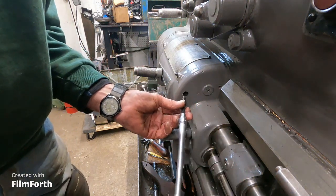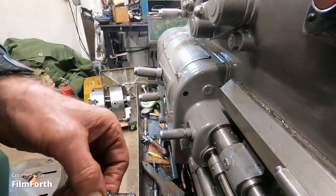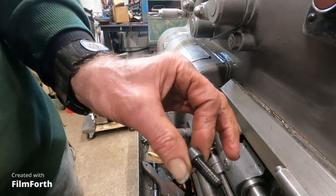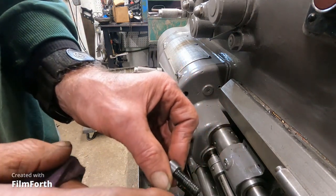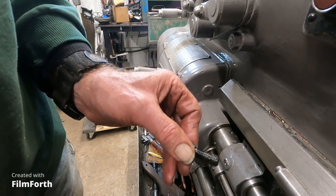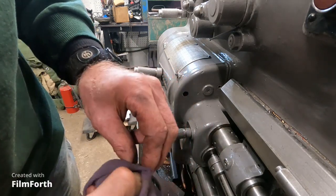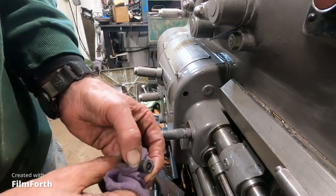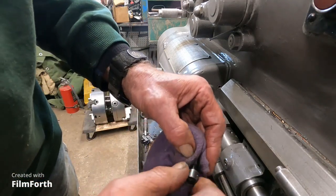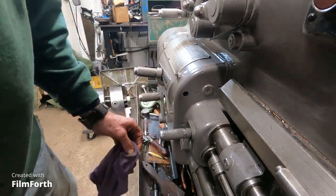Oh, whoa, that's got that 111 trichloroethane. It has a very strong metallic smell. It was an old tapping fluid that was used back in the 1980s, and it runs into places like that and it still hides. And this is the last hiding place for that stuff. This lathe was so bad with this, I scraped every bit of paint off this.